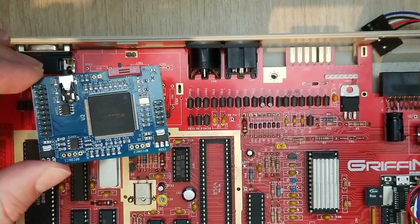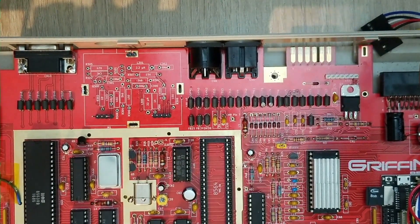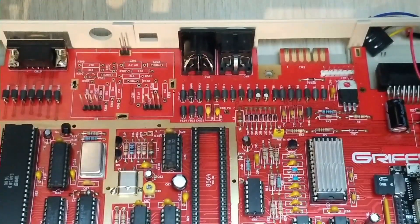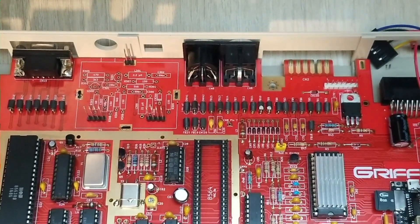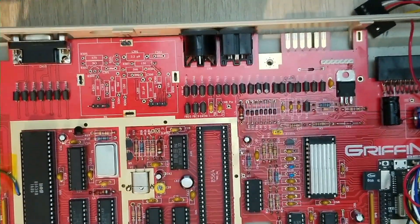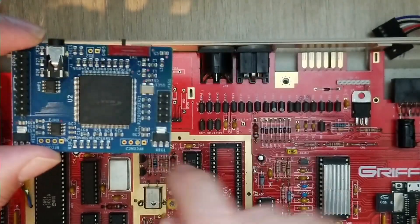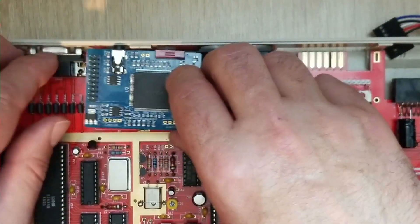I've fitted all kinds of different modulators on 128 and 64 short boards — things that were intended to be there, things that weren't supposed to be there, and everything in between. So we're just down to the bare modulator section. These are the super long 2.54mm square pins — not those cheap machine pins, which I guess have their place, but they're kind of weak. These things are pretty tough. All of these are soldered on the bottom of the board already, everything attached underneath. There are two mount holes bonded together electrically, probably bonded to ground, and those two pins go to the same place. Then obviously these are our signals and five volts and all that coming in.